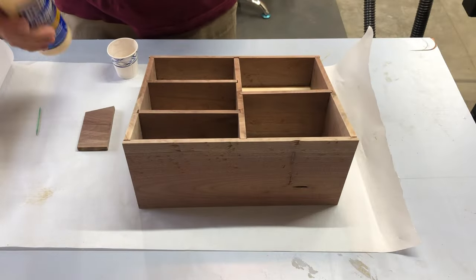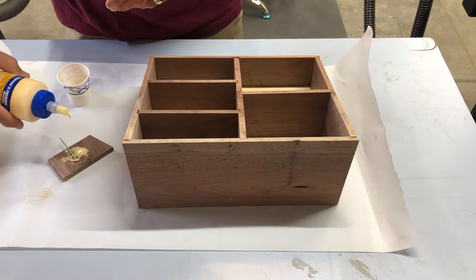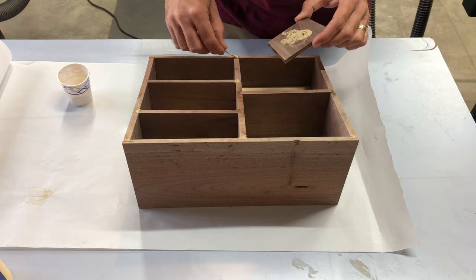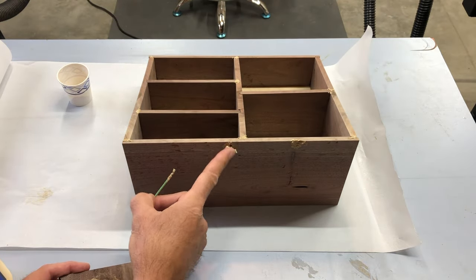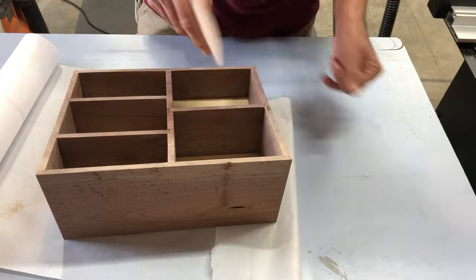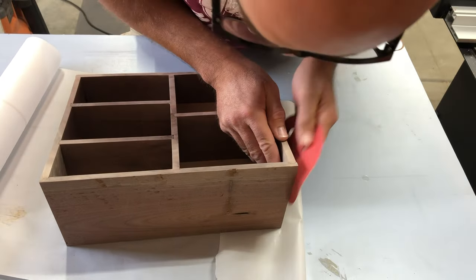I did not do my finish before the glue up, so right now I'm mixing a little bit of my sawdust — I actually sift it out to get the big pieces out — mixing my sawdust with some glue. Now you'll see I am cleaning up my little imperfections. I always say I'm not perfect and neither is my work, so I'm just going to fill those in. And now I'm filling the tear outs in at the back — these are the ones that I couldn't really get rid of. You'll see that the finish does not adhere to that glue mix at all. So after that sets up, I'm taking just a piece of sandpaper and cleaning up all of those glue-filled areas.